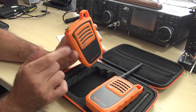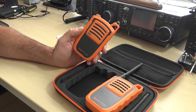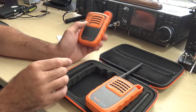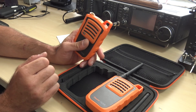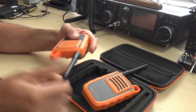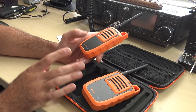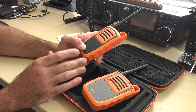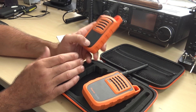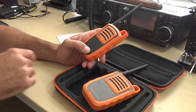There's an SMA connector on the top. I actually have a video coming up on an antenna I saw on Josh's channel that I'm going to use on this, because like any radio, the better the antenna, the more range. It does come with two SMA UHF antennas, which will give suitable line-of-sight range — probably a kilometer or two. They advertise up to 20-mile range, but I think that would be absolute line of sight, mountaintop to mountaintop. Real-life, probably a mile or two.